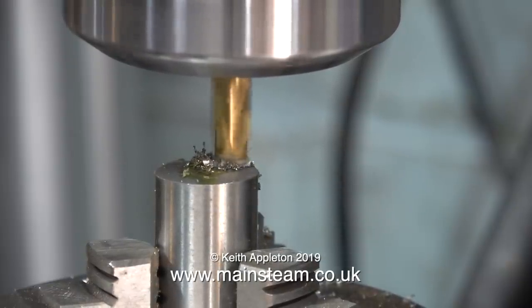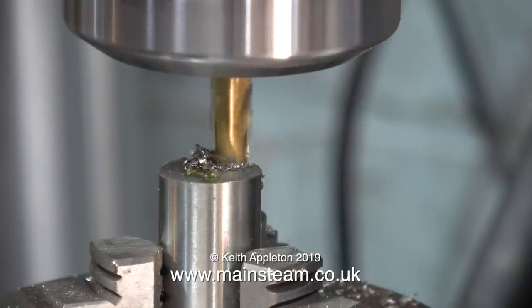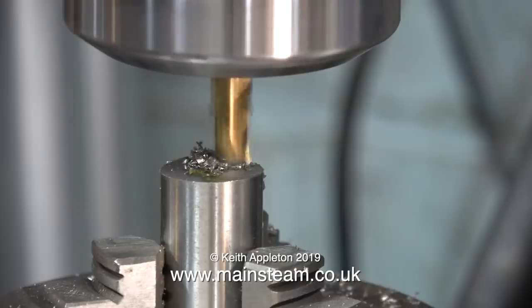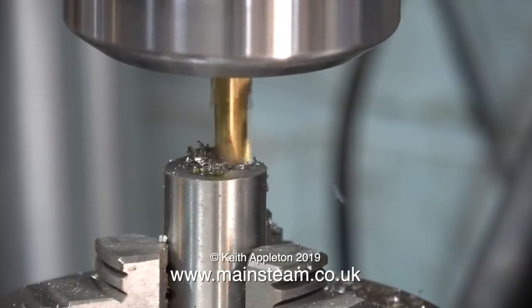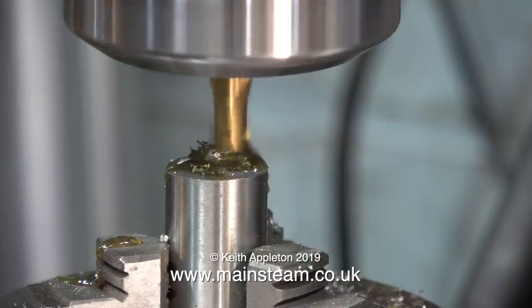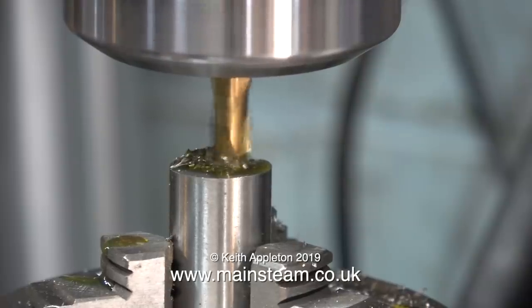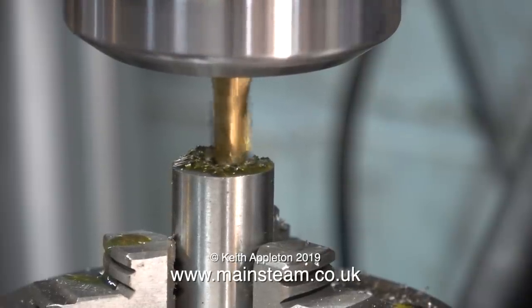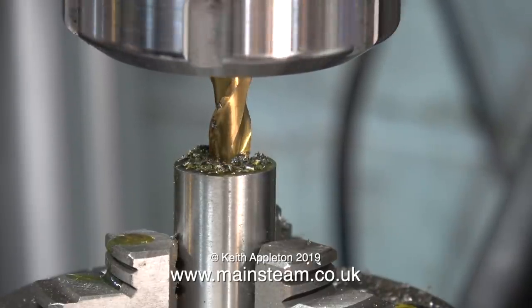I don't wish to be picky, but I don't like the noise it's making. If I was using my normal very old tailstock chuck for this job, it wouldn't make a noise like this — something is loose. To be fair though, I am milling it dry. I'll put a bit of oil on the cutter. Once I applied the oil the tone changed, but then when I applied the pressure again — look what happened. The problem is the collet isn't tight enough, and I cannot tighten the collet because I cannot lock the spindle.